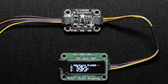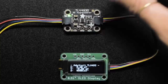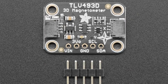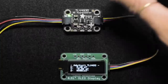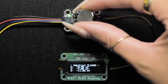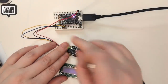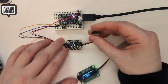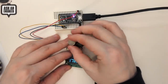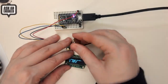The star of the show tonight is the TLV493D triple-axis magnetometer. This is a STEMMA board and I've got it connected up to an OLED. It was suggested by Phil B quite a while ago. It is a very low-cost magnetometer. The key thing about this magnetometer is it's not good for detecting Earth's magnetic field — you can't tell which way north is because it's not very precise for that. What it is good at is detecting a strong magnet up close. As I get closer with this magnet, you can see the X and Y values tell me where the magnet is located.